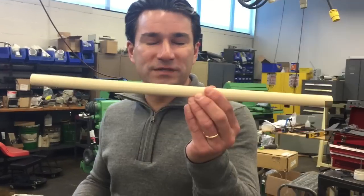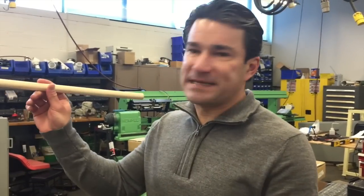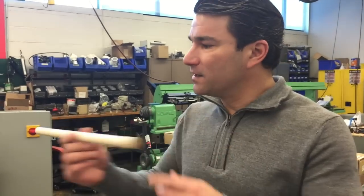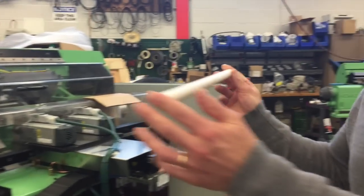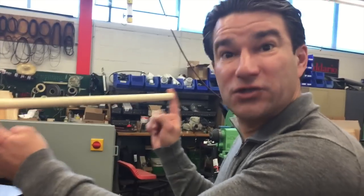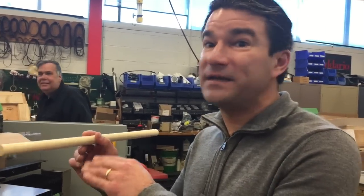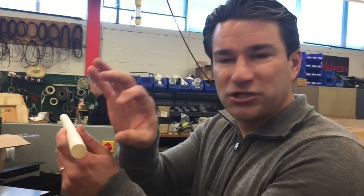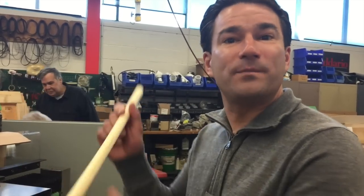This is a dowel we produced down in Tennessee at our sawmill, cut from a hickory log, and generally dowels are never going to be perfectly straight. Neither are the drummers who play them. So what we're doing with this lathe is it's going to be held on two different ends and it's actually going to shave just portions of it to actually straighten it. So yes, you're going to get some dowels that are perfectly straight and will make a perfect drumstick, but a lot of times the input material isn't always straight, so we shave it down to a perfectly straight dowel to yield the stick — otherwise it would be thrown away.